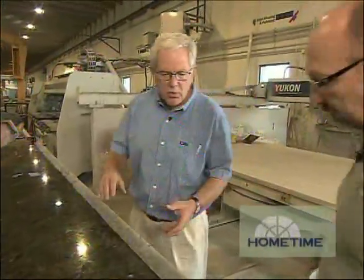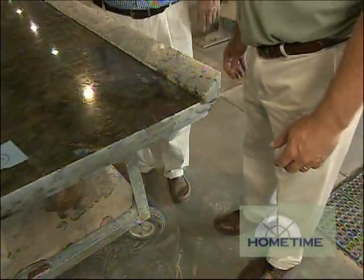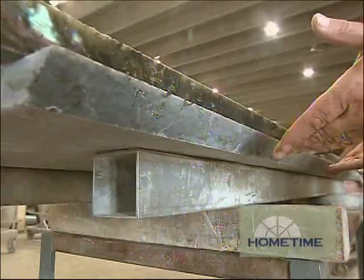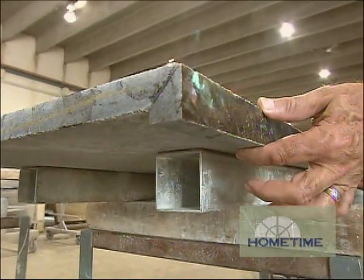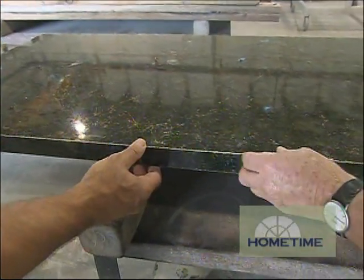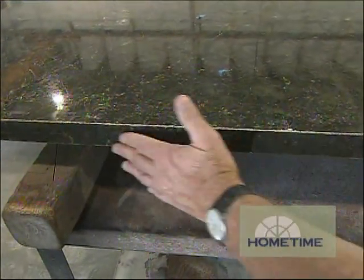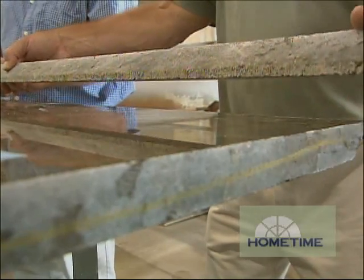One thing Craig mentioned is that because we want an edge that is thicker than our slab — we're only inch and a quarter — we want to go wider. What you guys do is miter the edge. The beauty of mitering an edge is it gives you the ability to drop a rail down and glue it in place, and then you actually lose the seam in the edge itself with a hand polisher, smoothing it out into a nice soft round. So it's all going to look like one piece coming down the edge. With really wild marbles you can see a very distinct line when you butt two pieces together — the miter hides that. And remember, the miter edge can only be done on straight runs; any radius has to be stacked, like the island will be stacked.